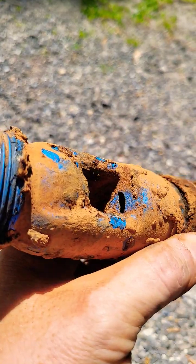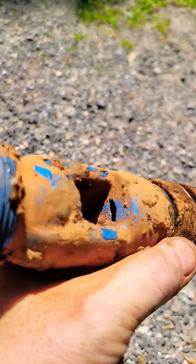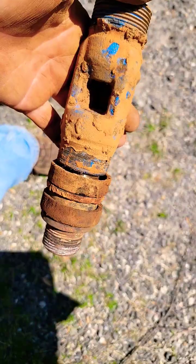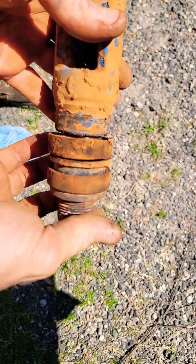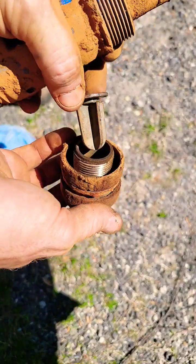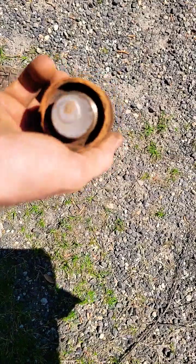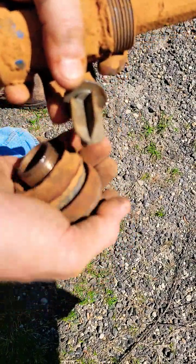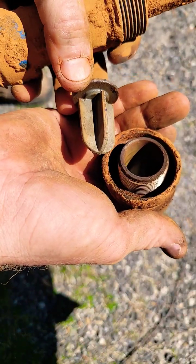The jet can get a hole in it — you can see that worn hole right there. By taking the leather assembly off, I can show you the falling check valve right here. This seals this way. Unfortunately this commonly goes bad because there's a rubber that's missing from this part.